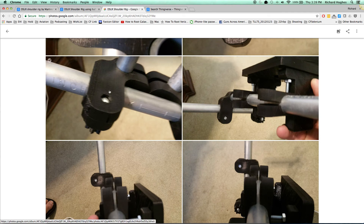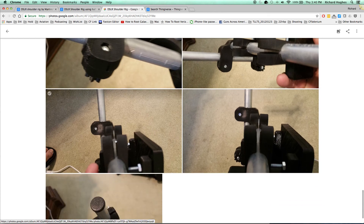What I did was print it at 15% infill and 1.5 millimeter external layers. This was also kind of butterflying out. This is one of the originals and this is my new print — I opened up the hole to 19 millimeters, again with 1.5 millimeter outside layer and 15% infill. You can see the tabs are more parallel. That's the end piece.